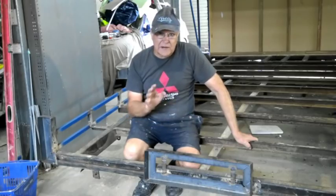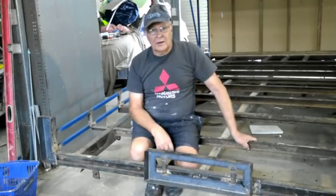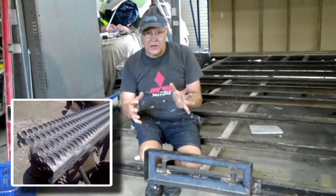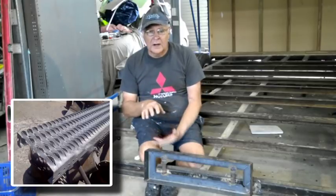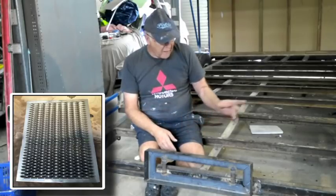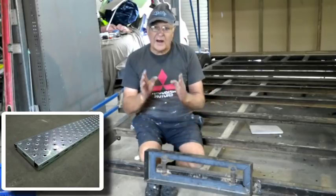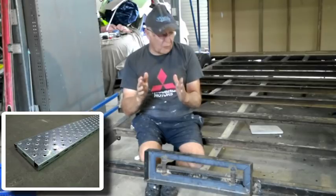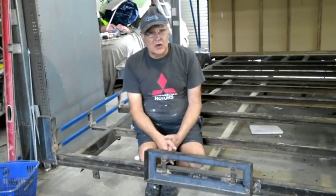Before we leave scaffolding planks — you can get very thin sheet metal scaffolding planks. It's like an expanded mesh, not quite an expanded mesh. It's still sheet metal but it's got expanded grooves in it so that on scaffolding the workers' feet don't slip when it's wet. It does make very good car trailer floors — very lightweight and strong enough for most cars. The only disadvantage is it comes in the width of a scaffold plank, so you've got to use two strips. But if you want to build a very lightweight car trailer for a lightweight car, that sheet metal expanded scaffolding is certainly worth a look.